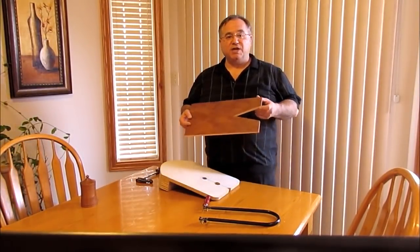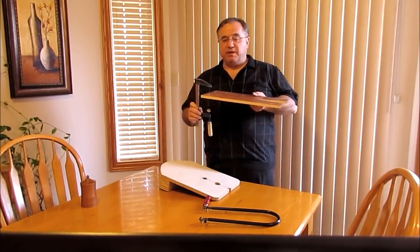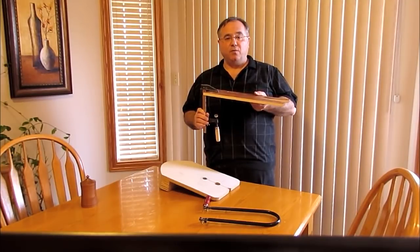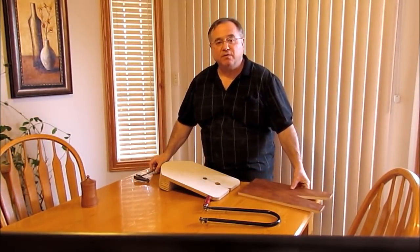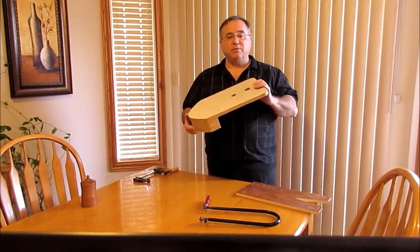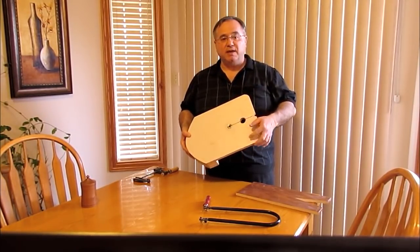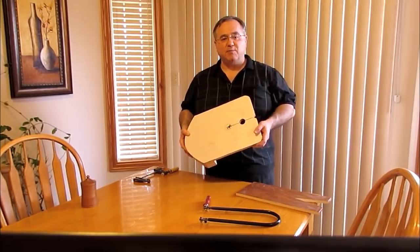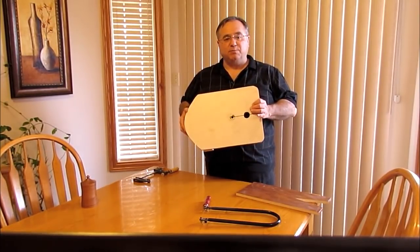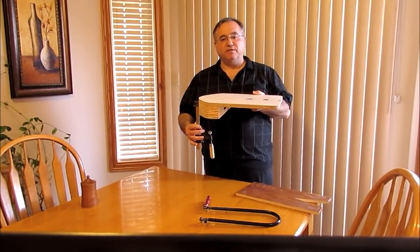The simplest form of cutting table is a board with a V-notch cut into it. This is called a bird's mouth. You simply clamp it to any flat surface and you're ready to go. I made my table from a leftover sink cutout from a laminate countertop and some 3/4-inch plywood. Instead of the bird's mouth, it has a slot cut into it and a metal washer inserted flush to the table. It provides a larger surface to support the work, and like the bird's mouth, it simply clamps to any tabletop surface.